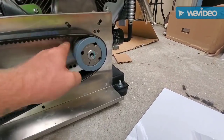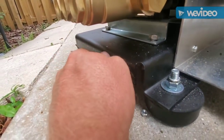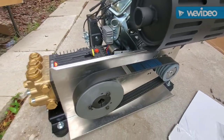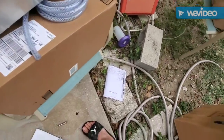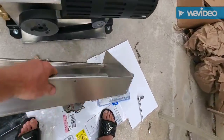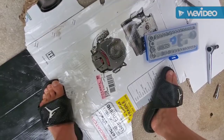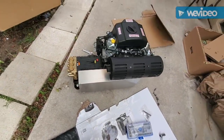Same thing: bushing and then the little pulley. I've got the belt on, and this tensioner down here you tighten to pull the pump this way, so the belt gets nice and tight. Just got to put the cover on — and we're in there.